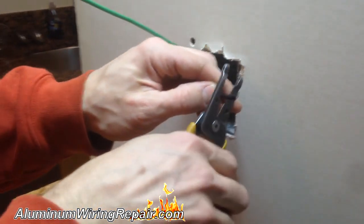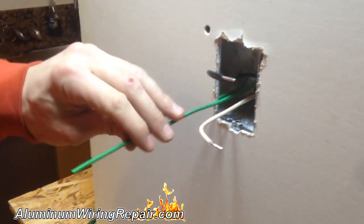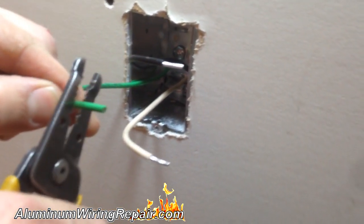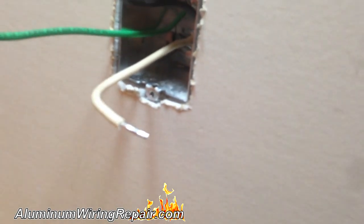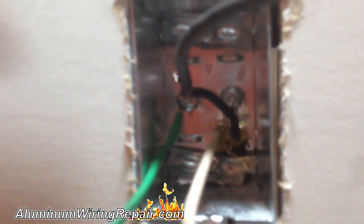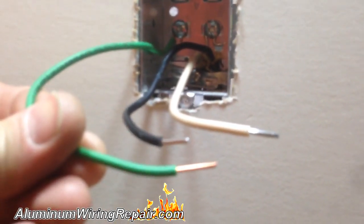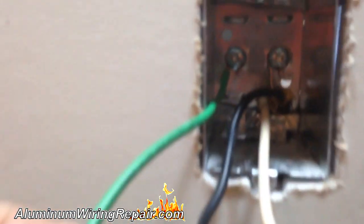The proper installation according to the manufacturer, King Innovation, specifies stripping roughly 5/16ths of an inch from the end. You have to be careful not to score the aluminum — this is very critical when dealing with aluminum. If we take a quick look inside the box, you can see the old aluminum wire coming in from the bottom right-hand side. These are two aluminum wires — you can tell by that brilliant aluminum color. And then we've got the copper. At the back you can also see how the aluminum ground wire is attached to the back of the box under the screw, and the copper ground will come out to the device.